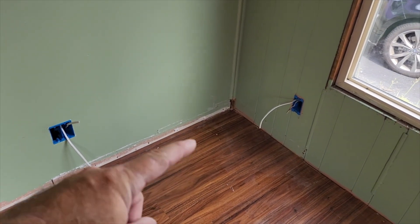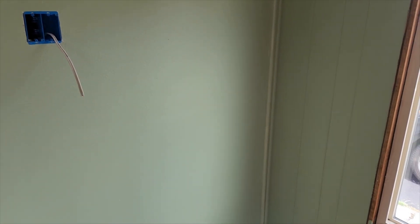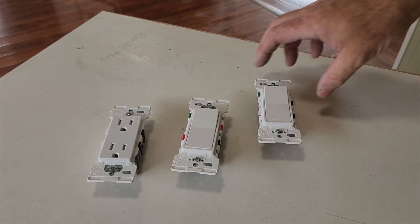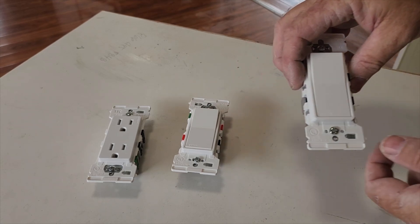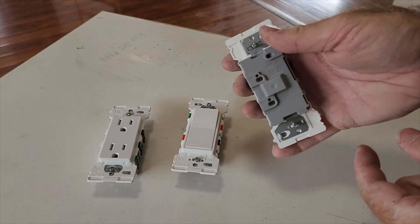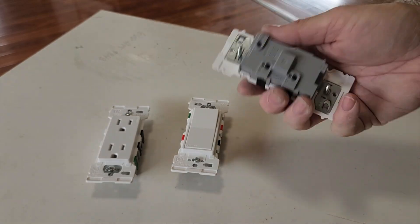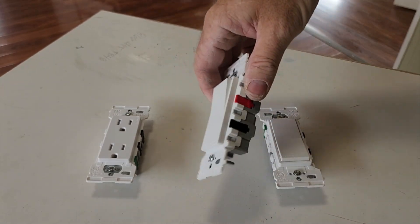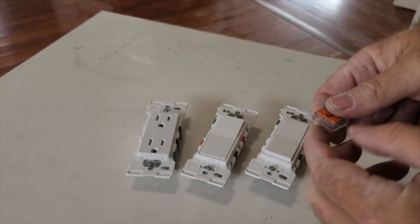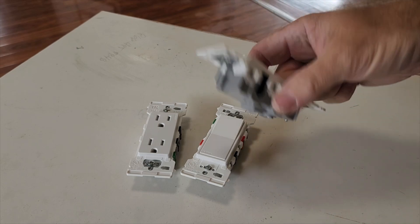I got all the drywall and paneling back in place, the boxes installed, and I'm ready to put in the receptacles. These are the Decora Edge from Leviton — they use a wire-from-the-back design, but not a stab-back like cheaper outlets. They use a lever technology where you set the wire in and then lock it. Here's a standard switch, a three-way switch, and a standard outlet. The lever is similar to Wago technology and uses 25 inch-pounds of force to hold the wire — it feels much more substantial.